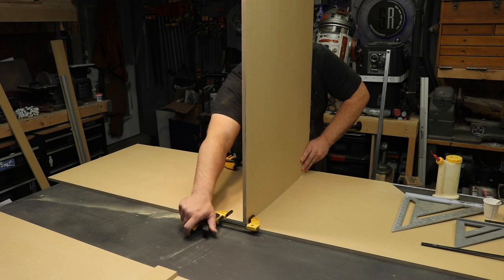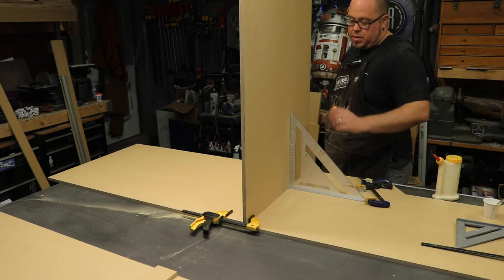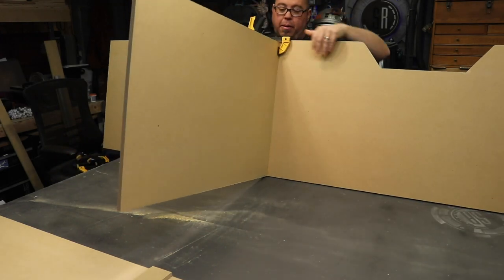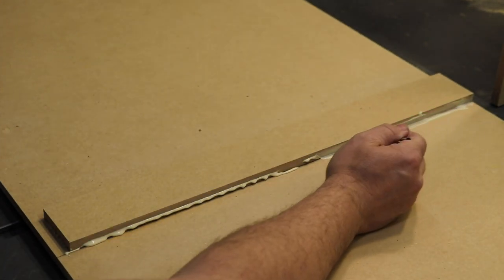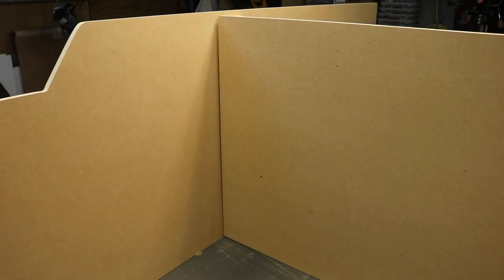But this is 1/2 inch MDF. And if I route the channel in the left and right panels, I'm not gonna have as much material or strong enough material to support the weight of the cabinet in the shelf. You might argue that that could be done, and you might be right. But for extra stability, I'm adding these strips for support. Again, if you're looking to how to build a perfect wooden cabinet, this is not the channel for you. But if you wanna make a ridiculous sci-fi cabinet, you're in the exact place you should be.